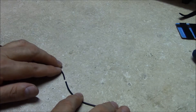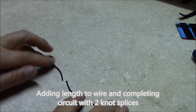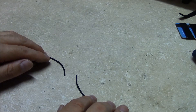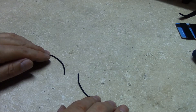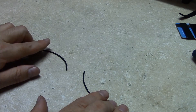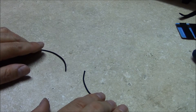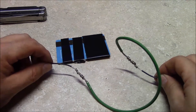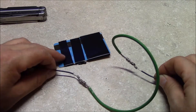A common scenario is this wire has been transected and it's installed banjo tight, and we don't have enough slack to complete our knotted splice. What we would do in that case is cannibalize a non-critical circuit to complete this critical circuit and place it back in service — by preparing both ends of our wire, then taking that cannibalized sectional wire and making a splice to complete the circuit. This is our cannibalized wire in our splice here, and all we would do is go ahead and insulate it with our tape.